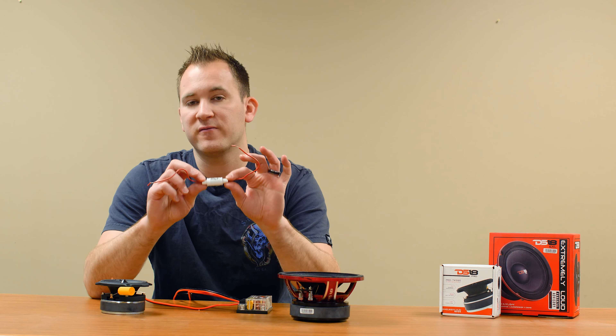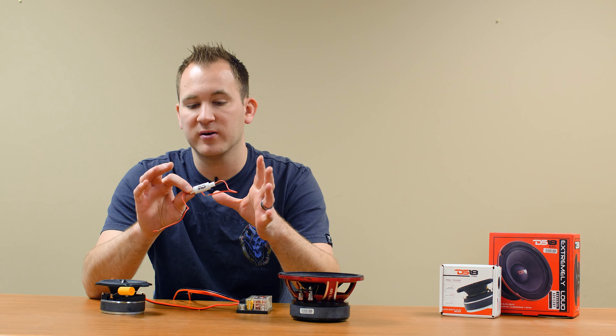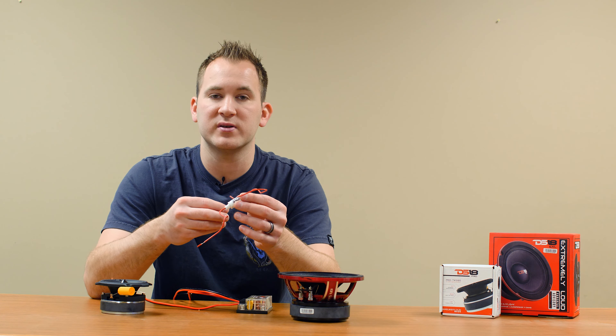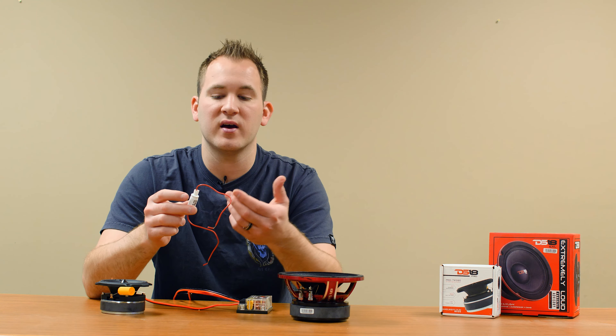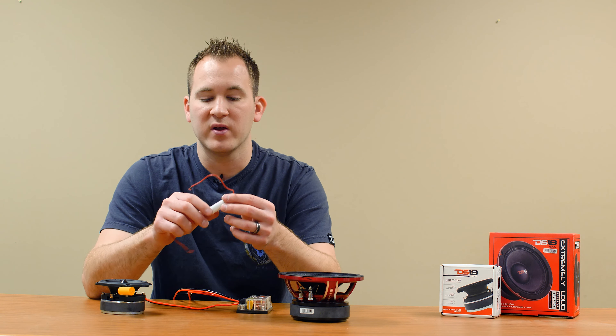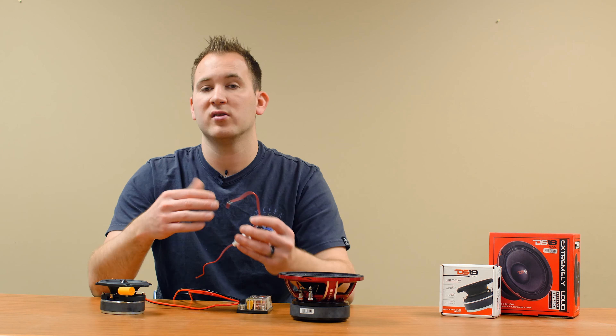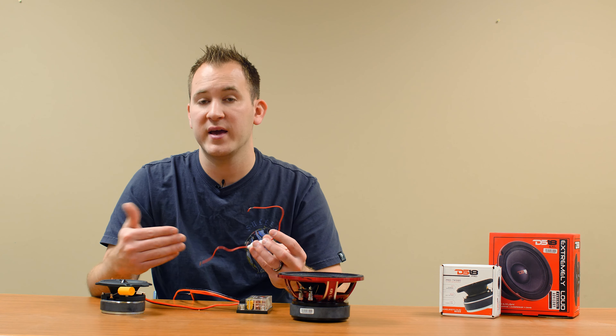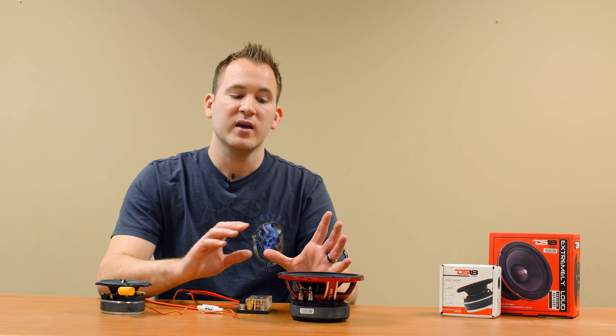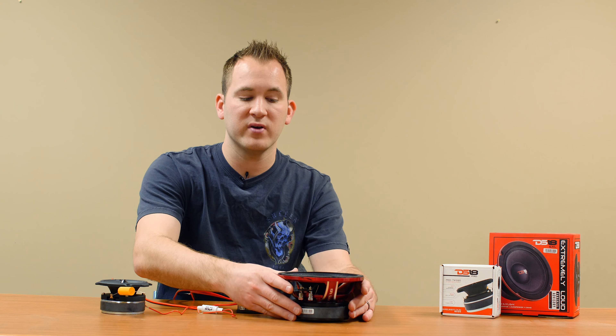For instance, this one is designed for a 5¼ to 6½ inch speaker and it's going to block out any frequencies below about 150 hertz — other brands can vary a little bit. So it's not going to let any of the low frequencies below 150 hertz, which produce more of the bass, get to the speaker or tweeter. In this application, we're going to refer to the mid-range.